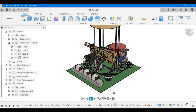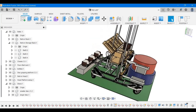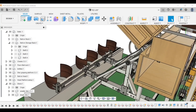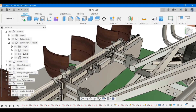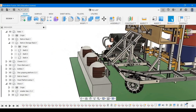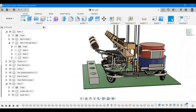This bot consists of four mechanisms: the ball picking mechanism, the disc picking mechanism, the ball passing mechanism, and the anti-interception mechanism. For the ball picking mechanism, the balls in the rack are picked up by grippers whose movement is controlled by a double-acting pneumatic cylinder, in turn controlled by a 5x3 solenoid valve — controlling the opening and closing of the gripper to hold the balls firmly.